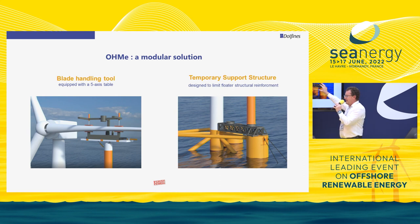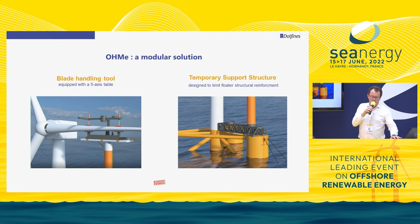You will keep one of these interface structures on your farm at your logistics base — you will build one in addition to your own reference floater. Later on, if there is a problem, you will rent the rest of the tooling. This ensures you always have an interface structure that fits your own floater, which is important offshore to avoid surprises when landing the structure.